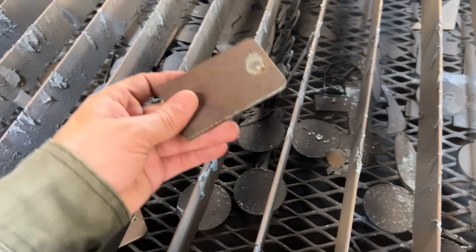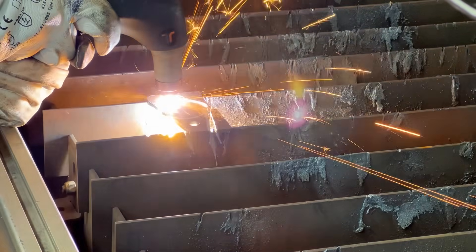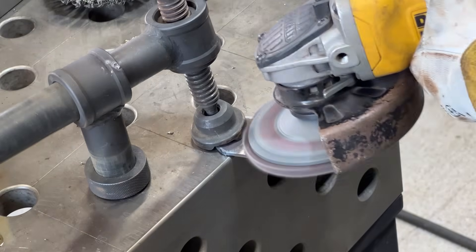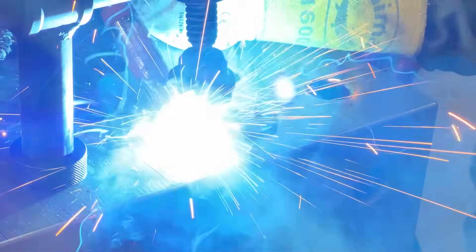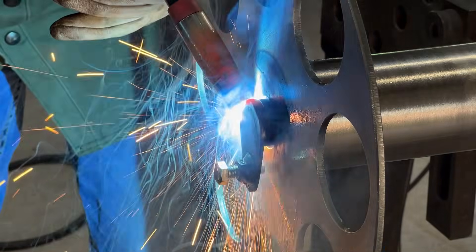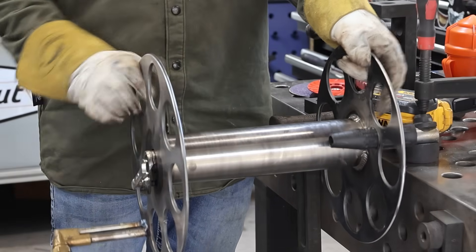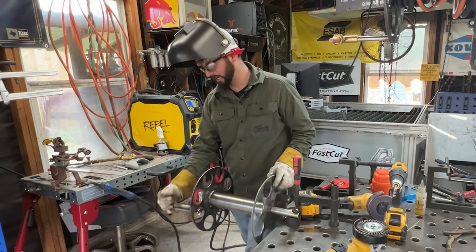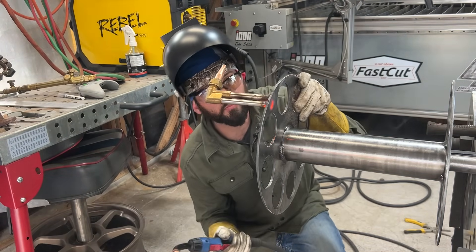Over on this side, I took a piece of 10-gauge plate I found at the plasma table, popped a hole in it with the drill, and cut it out with the plasma cutter. I had to do it again because it looked rough, but once recut it was decent enough to grind and shape to the piece we needed. Then we had the nut and bolt, stuck it through, lined everything up, clamped it down, welded the nut to everything, let it cool, and made sure everything was clean. After getting it welded to the end, I can weld this little wrench on as a handle — that gives me a brake and stop on this reel. I can slow it down, completely stop it, or let it free spool. Essentially the accessory bits are done. The reel is done. We've just got to attach it to our post now.